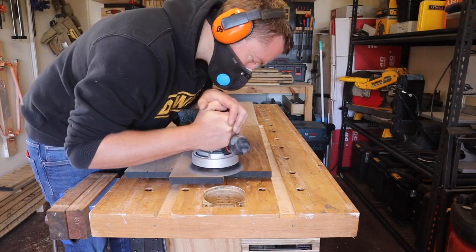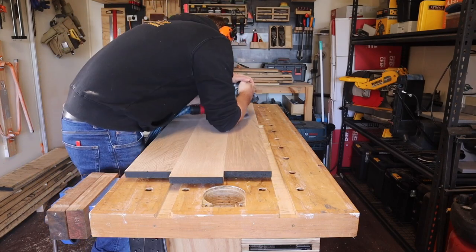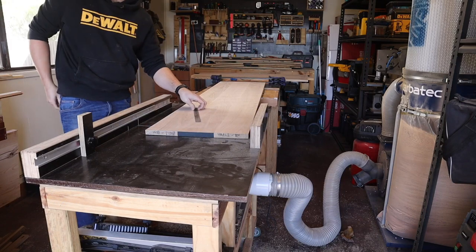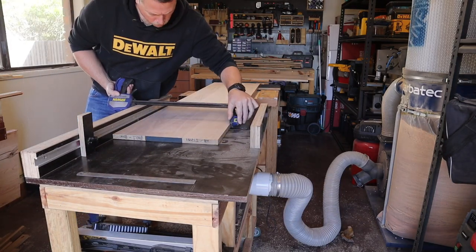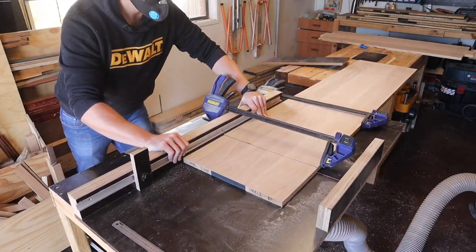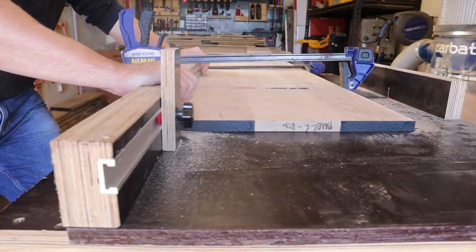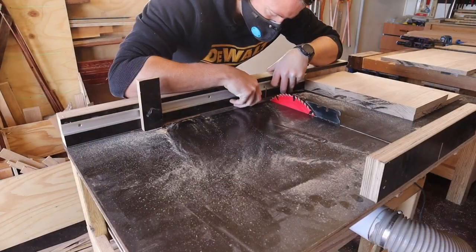As you can see, I love sanding. Time to cut the sides and top of the box. Using my crosscut sled, I cut the panel into three pieces, but to make sure I maximise that continuous waterfall grain that makes such a feature of this piece, I have to make sure that only a single saw kerf is always taken out of the joining mitres at the top corners.